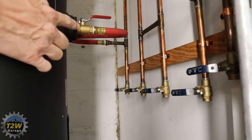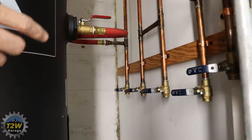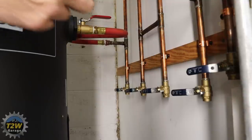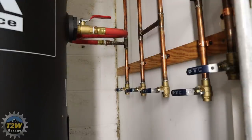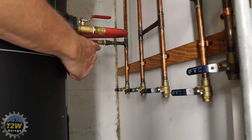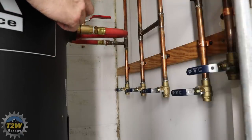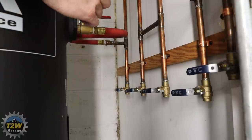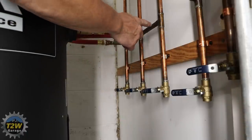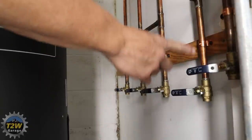Taking a closer look: this is the line that comes out of the tank — a half-inch connector — connected to a ball valve that was pre-installed in the tank, then to a flexible half-inch feeder hose. The flexible hose is important so it doesn't transfer vibration from the compressor to the rigid copper grid, which could break. The hose feeds into the far leg of the copper tubing. The copper tubing has four five-foot runs going up and down. Each down leg is where moisture can collect, so as the air travels up and back down those legs, moisture condenses into liquid water and falls to the bottom of each leg.